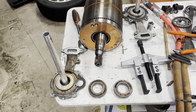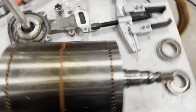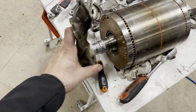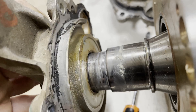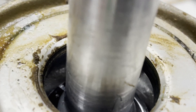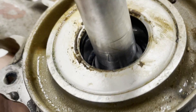Let's talk about the main cause of the issue on the ball bearings. The rotor is cooled with liquid coolant. What happens here is the coolant gets inside the ball bearings. The shaft seal fails completely — that is the main reason why it fails.